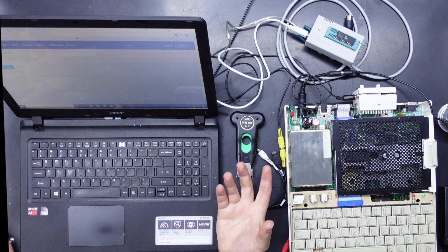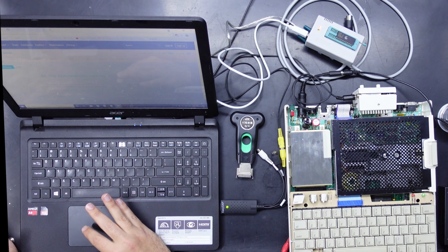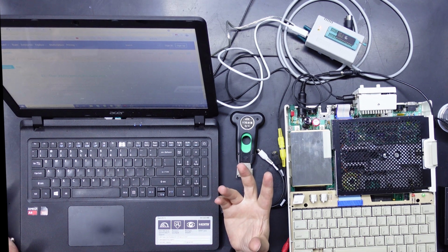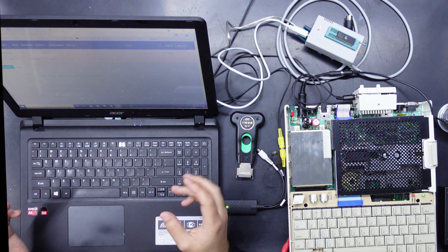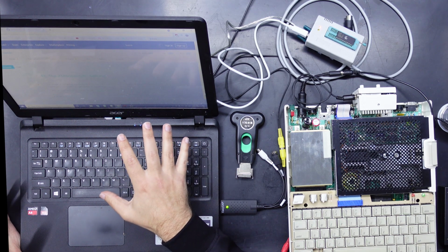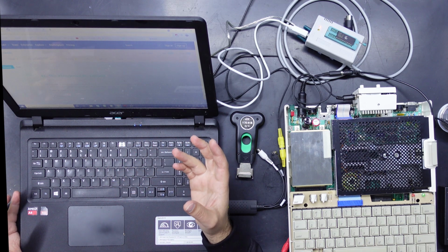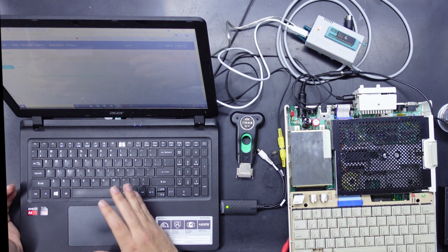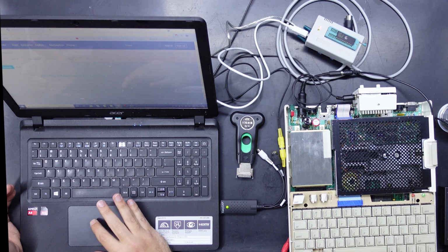So like I said, I'm running a Windows machine, and the ROM4x actually requires some Linux command line tools to actually compile it. So it basically downloads an original ROM from a reliable source and then patches that ROM. The download that you get off MG Carrot's GitHub page doesn't actually include the Apple ROM itself because of, you know, avoiding copyright issues. So it downloads the ROM and then applies a patch to it and gives you a binary output.